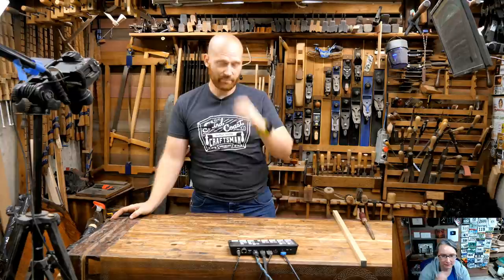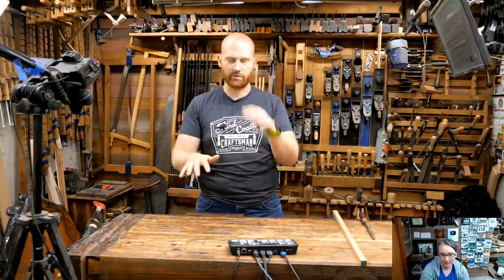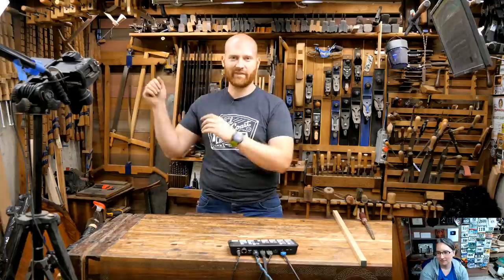Tiny Witch Up asks, ever think about making a split Roubo workbench? Not really. I've done some work on split tops, and I don't like them. The reason for split tops is not because it's historical. It's actually rather new. The reason is it's very rare to get a 20-inch thickness planer. Power tool people who want a good bench don't want to run massive slabs and glue them together, because then you'll have joint problems and have to flatten it afterwards. So they cut it in half, run one slab through, run the other slab through, and have a slot down the middle, and they say, ooh, this is for tool storage.